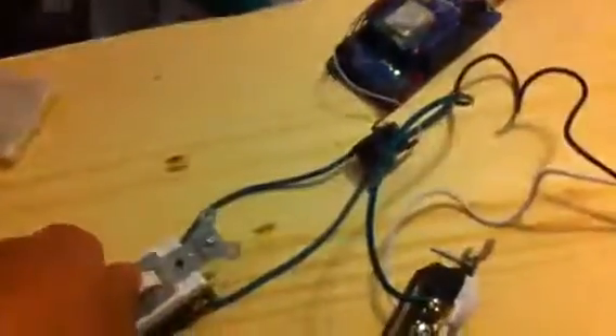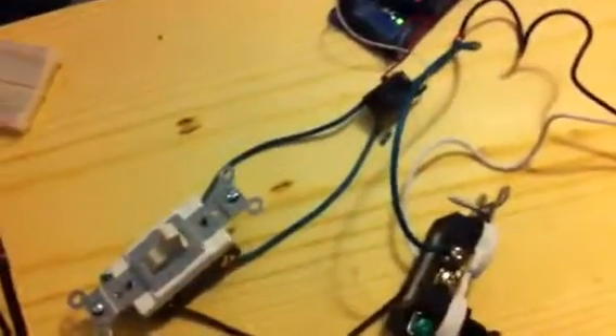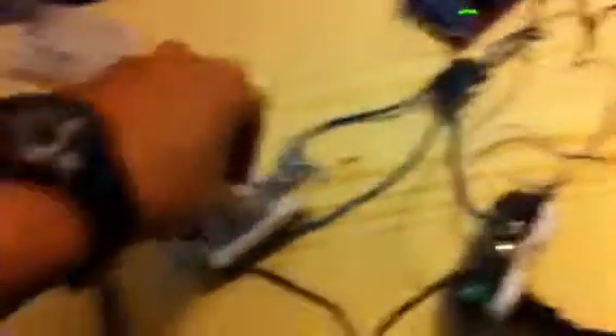Right now the light is on — it's connected to this outlet. If I switch this switch it's going to turn off the light — it's opening the circuit there. I turn it on, and here with the app I can trigger the relay, so there it switches off. But then I can take the switch and turn it on again. This allows people to turn it on and off with either one; one of them doesn't always have to be on. See, the switch is on and it's on — I can switch this so now it's off.